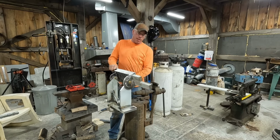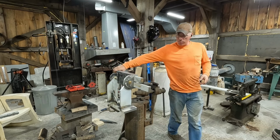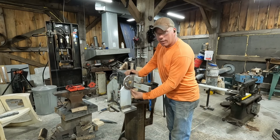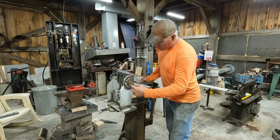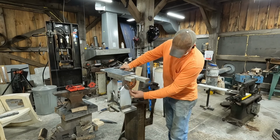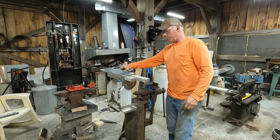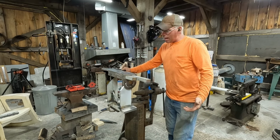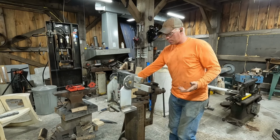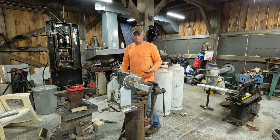Now, we're gonna be doing a locking lever on the front of this and also a locking knob that will thread into the 5/8 plate behind here. We're gonna notch it out right here and then another notch right here so that when we tilt it horizontal, that lever will have a spring on it so that locks it in place. Would be kind of nice, kind of a quick, easy. And that is not my design by any stretch. That is actually the KMG grinder design, but I really, really like it.